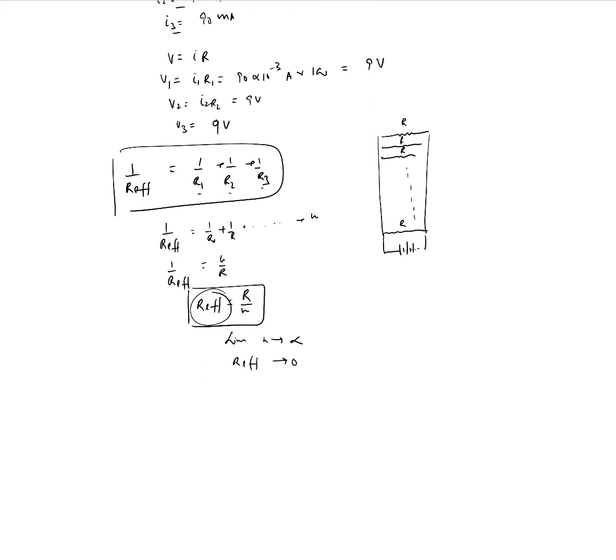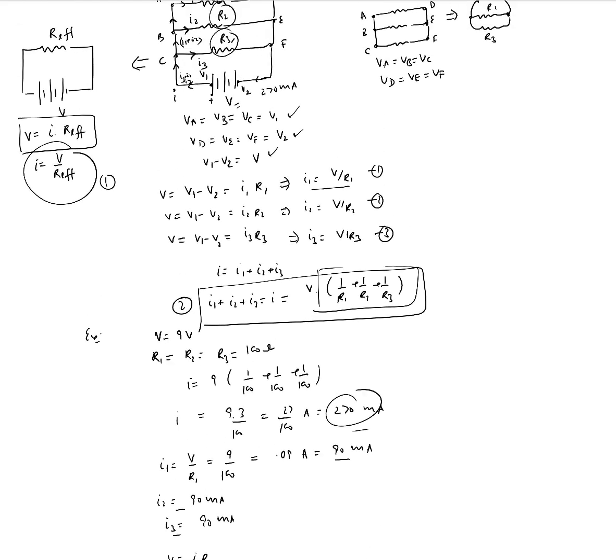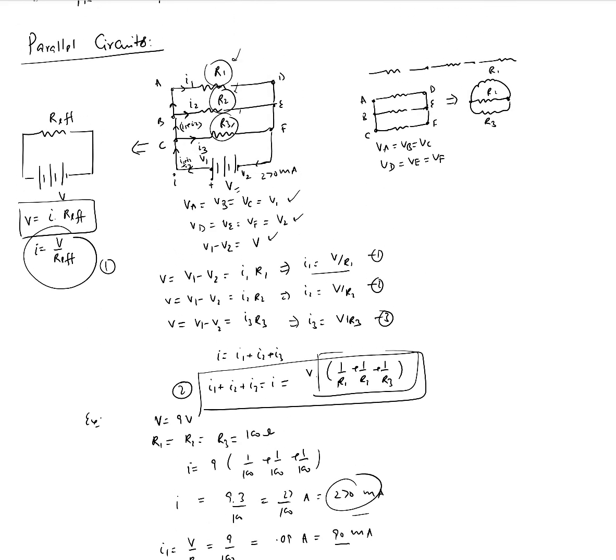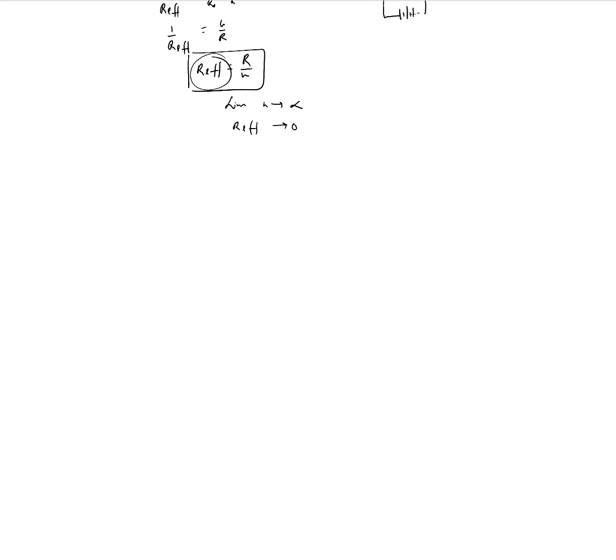At this point, if the question was how the appliances in a household are connected together, you probably know the answer — they're connected in parallel. Each of the appliances has a load, has a resistance. If you take one of these out, you only stop the current from flowing through that particular branch, and the current continues to flow through the rest of the loads.